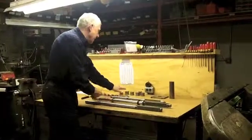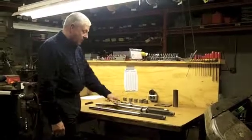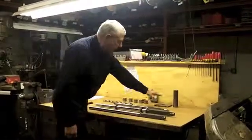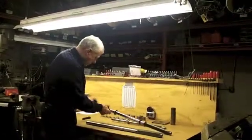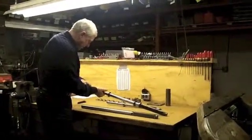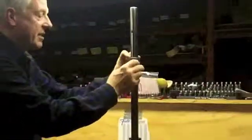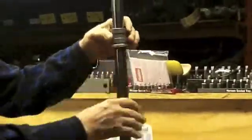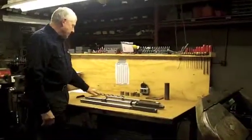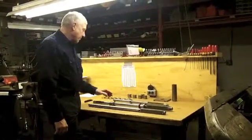We are providing you with a total of six swedging dies for the different diameter bars, a base plate, and a pressing plate. When you use this tooling, you will slide the swedging tool over the rack bar and with a hydraulic press, you will be able to press and swedge the piston back into the groove on the rack bar rather than the old way of rolling it. We also have available seven different pistons for the racks that require this operation.